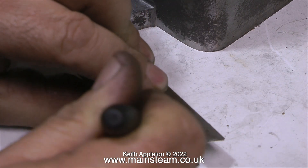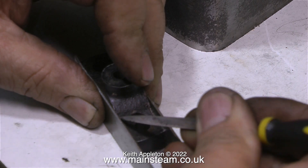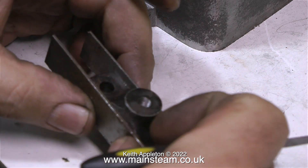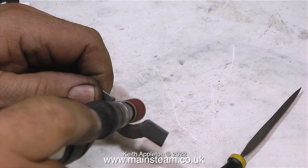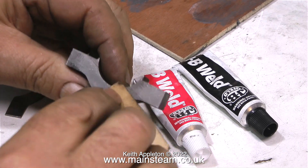This job starts by marking out the sheet metal — just holding it against the top cap and scribing it with a needle file. After marking out, I cut the pieces to size on the bandsaw, then finish them off using a one-inch belt sander followed by a small drum sander. It's most important to clean up the parts that you're going to stick with JB Weld.